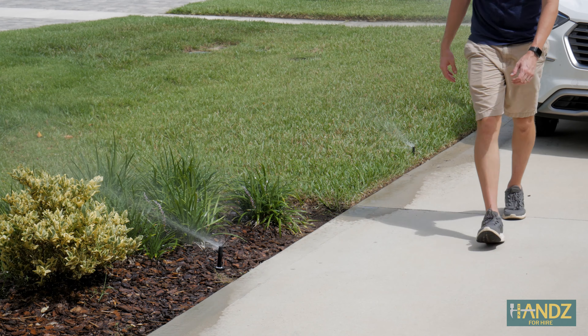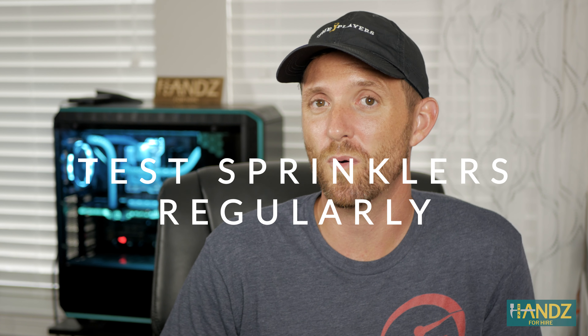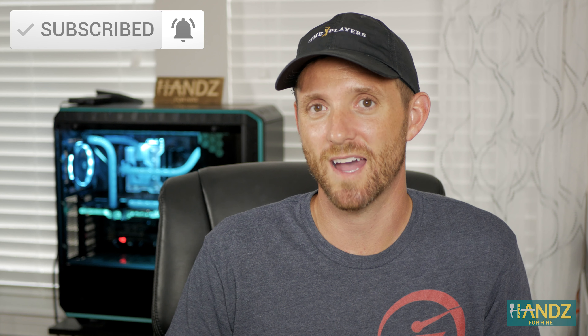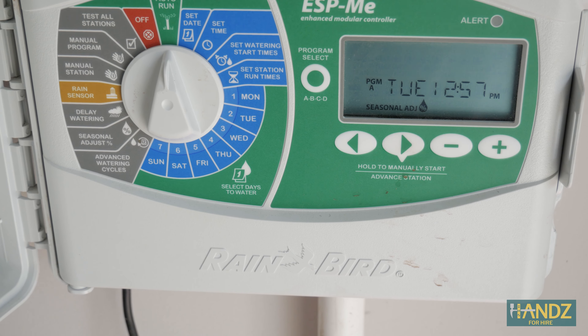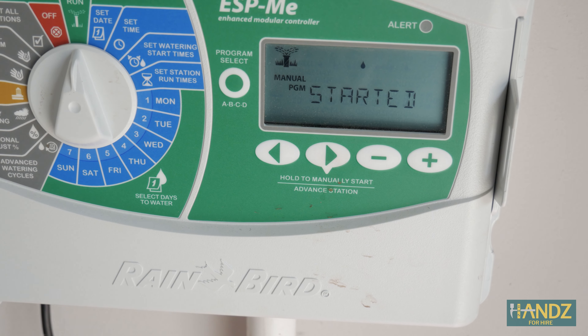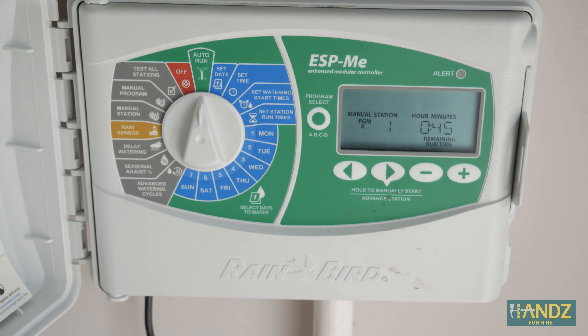The next part of this video is how to maintain your sprinkler system. If you have a sprinkler system, it's important to always check to make sure it's working properly. The sprinkler system is so fragile that the plastic pipes can break easily. If you aren't inspecting regularly, the sprinkler system might come on in the middle of the night and you could be leaking hundreds of gallons of water each night — which not only wastes water but drives up your bill. By checking every few months, your entire system will run more smoothly and efficiently. In our house, we have four zones, so we're going to start the test with zone one — just a visual inspection to see how everything's working.